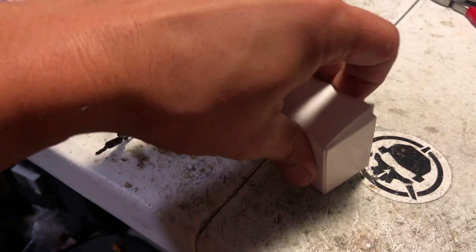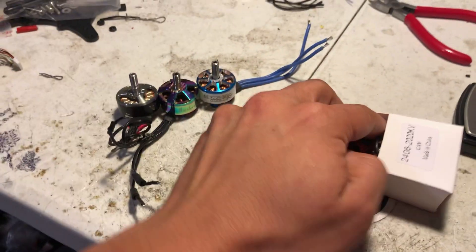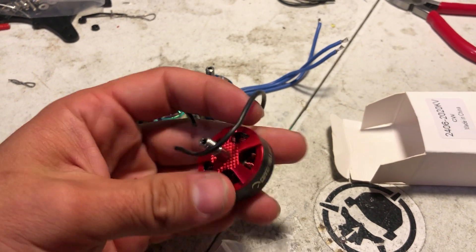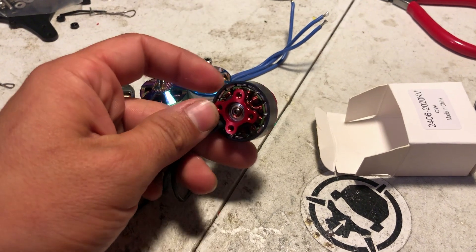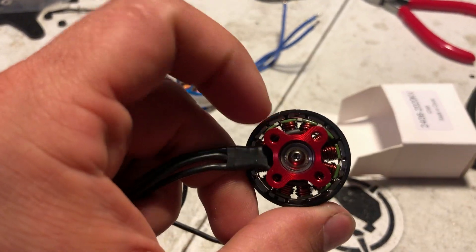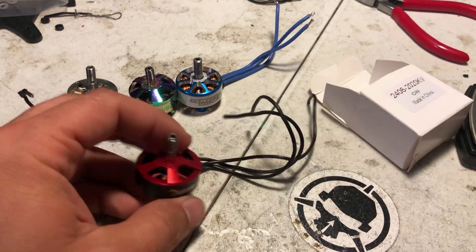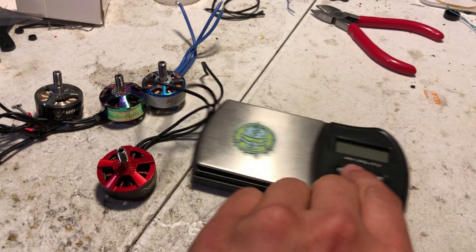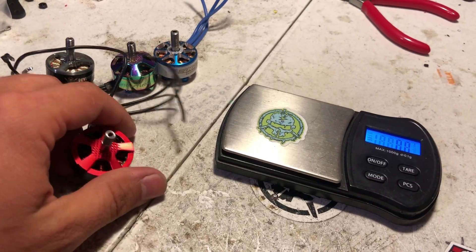So what I've arrived at is these 2406 2020KV motors. You can see my logo on there — this is obviously manufactured by Brother Hobby based on their popular R6 design. A few things I asked for that the R6 doesn't have: a lip here to hold the magnets in, which gives it a bit more reliability, and it has the prop grip as well. A lot of feedback I get is, 'Hey, that motor is going to be way too heavy for racing — a 2406, that's a beast.' Well, you'd be surprised — it's roughly 3% more total stator volume than a 2207.